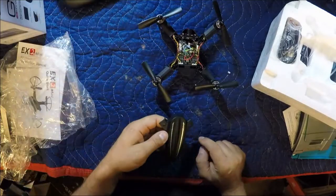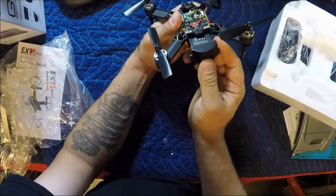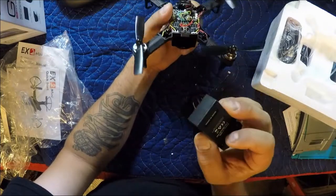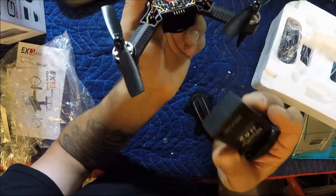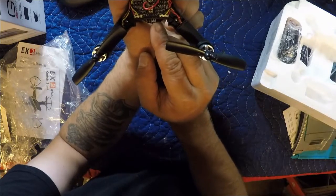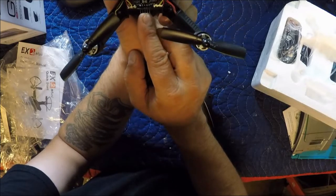Sweet guys, we got a battery in here. A little spring-loaded — push up on that, pull the tab out on the side, and the battery just slips in. It's got a little cover on it. So we're going to do a mod so we can use either the stock battery or an aftermarket one. I believe guys have been pigtailing right off the board here — the outer two pins on the left are your positive, the outer two on the right are your negative, and the middle looks blank, not soldered to anything.